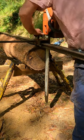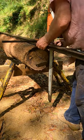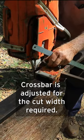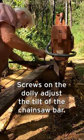I'm going to make a beam out of this that's 160 by 160 roughly, so I'm going to set the blade 80 mils from the center. Then I'm going to make sure that it's upright. This one, the blade's leading in a little bit this way, so I'm going to adjust that.